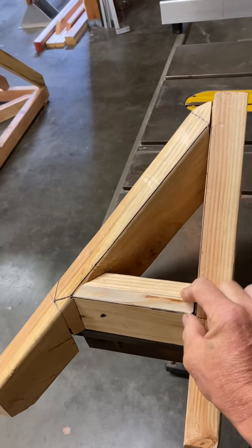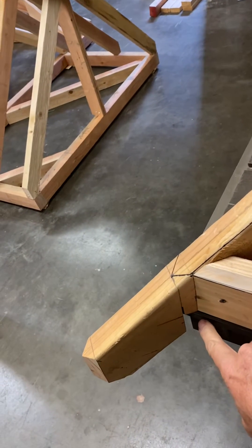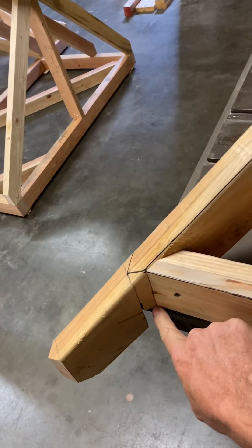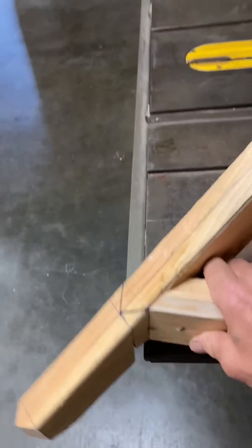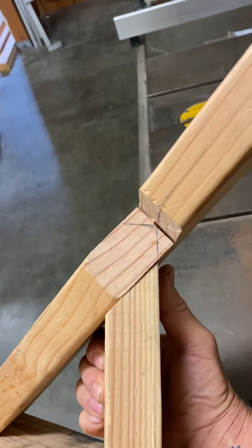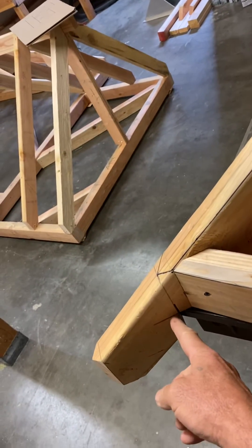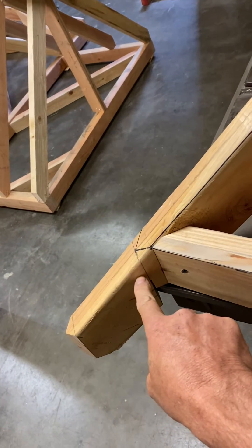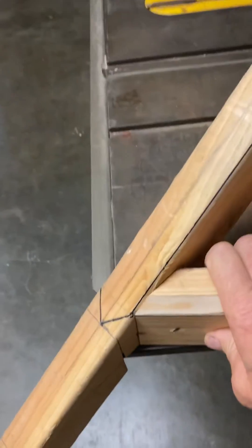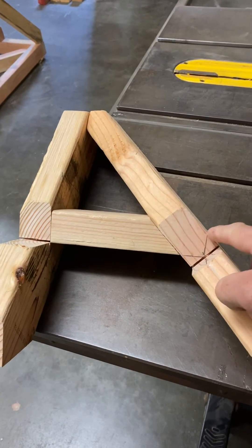Take a look at this mock-up — it's a good one. Generally you would have the entire top of the block bevel, but this was a 2x4 so it wasn't enough. You can see how it dies into the side of where the rafter runs through the plate. Looking straight down on it, you can see the point of the corner beneath. The length of the rafter is longer than that of the heel stand — it's cut to here, but the heel stand is calculated three quarters of an inch back on the level on a 2x4. The answer is because it's an inch and a half thick, and this little triangle here is a 45-degree angle because it's a 90-degree corner with a 45.